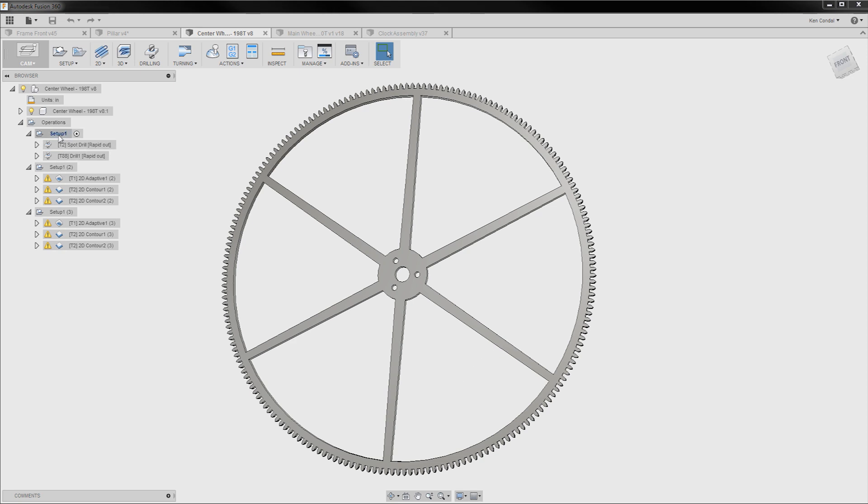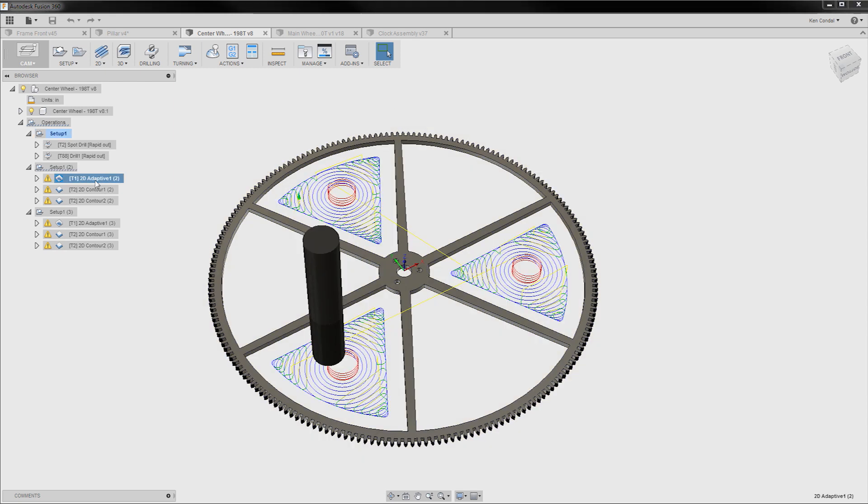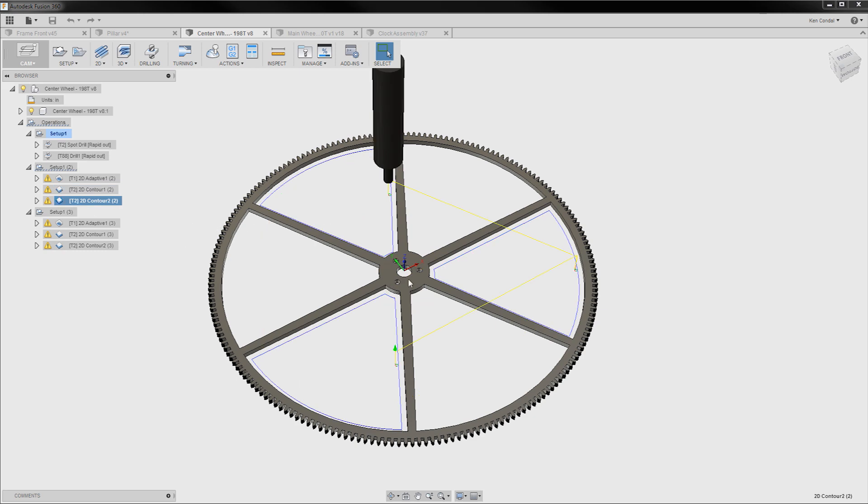I pointed out that all G-code instructions have to be referenced from a point which is X and Y zero. We chose that point as the center hole of the gear because each of the gears I made had a center hole drilled and reamed for a dowel pin, so that we could relocate it from the lathe to the mill and back again. So once the machine knows where X and Y zero is, all of these instructions — the paths that the tool is going to take to clear material out — are all based relative to this X, Y zero point.